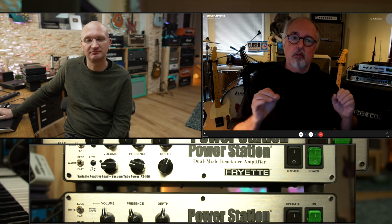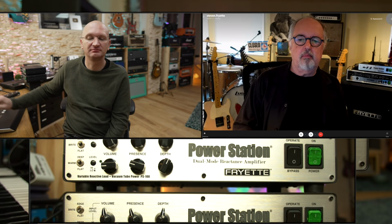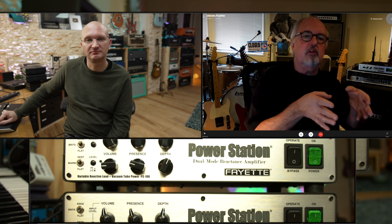And my position is that it generally is, that that's not really a concern. All they're doing on their load is front-loading the reactive behavior more so that the solid state power amp at the end will seem more reactive. And that's a good thing. I mean, that would have been a good engineering decision to make. And they, of course, went with a solid state power amp to reduce cost and weight on that part of the design so they can focus more of the product budget into the signal processing, which is great.